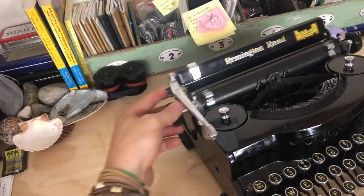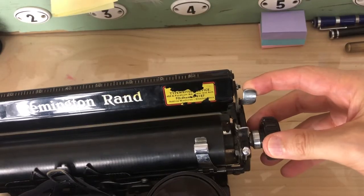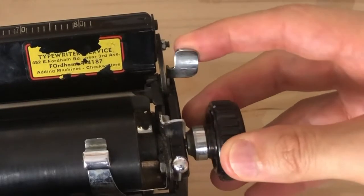The second thing I'm noticing is that the carriage return levers on either side — the left one seems to be working, but the right one is not. In many of these machines the left and right levers are actually hooked into one another: when you depress one, the other goes as well and vice versa. However, on this machine — and I've noticed it on a lot of Remington Rands — they are actually independent switches of one another.